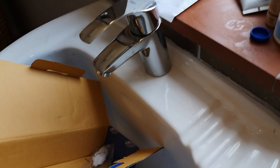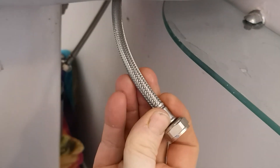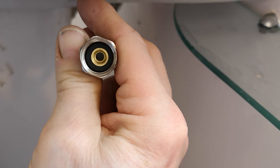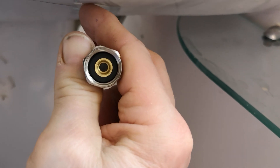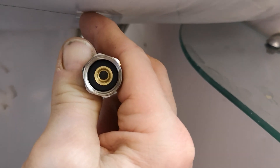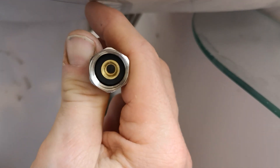I'll show you the ends of the tails — if I pull a tail end up here, you can see the hose is pretty small: about eight or nine millimetres diameter. The central hole in there — I've drilled that out because it was four millimetres when I got it, which is tiny. I've put a 4.5mm drill down there to make the hole that much bigger. On a high-pressure system it's fine, but no good on ours. You can't really change these skinny pipes and there's no evident way of taking them out of the tap block.